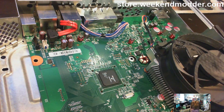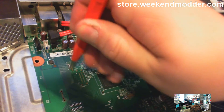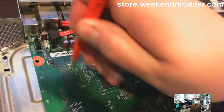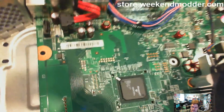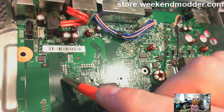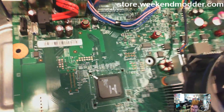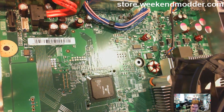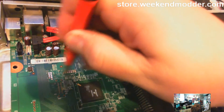The first thing is going to be using the fiberglass scratch pen to prep the surface of these pads. I'm just scraping off the top little layer — you should be able to see how much shinier those pads are versus the ones on the right. This is the one I've already prepped versus the one I haven't — it's got kind of a dull look to it. Taking off that first layer will allow your solder to stick much more thoroughly.